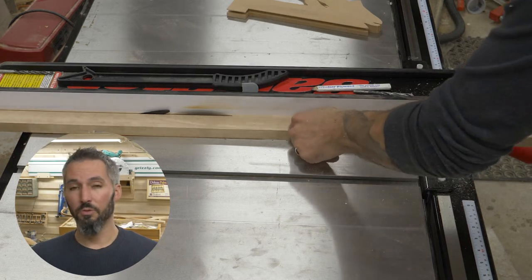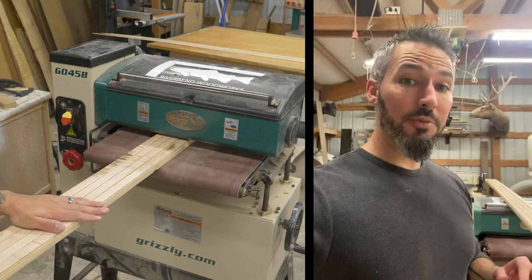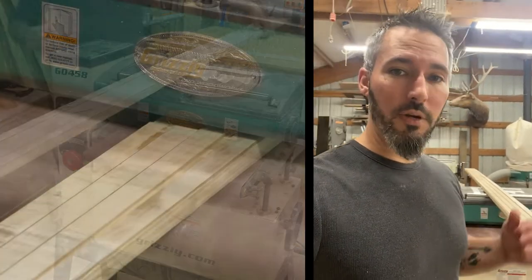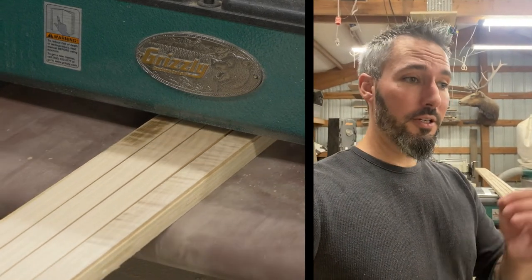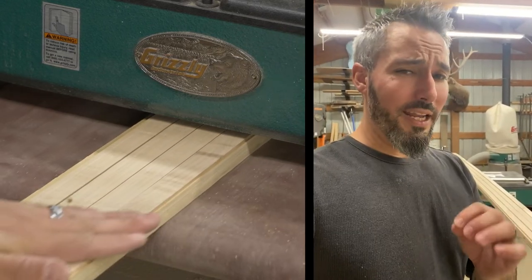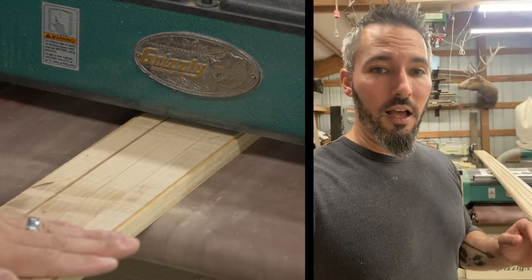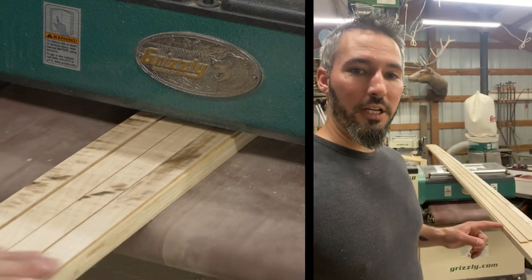I discovered with maple that you want to cut your net strips or hoop strips as thin as possible — think about an eighth of an inch right out of the table saw, then run through the drum sander. When it comes to making the best net hoop possible you've got to have really flat work pieces. You can have a really clean cut on the table saw and bandsaw when you're ripping out your 1/8-inch strips, but you still want to make sure the glue has something good to bond to and you have no saw kerf. The drum sander has about a 1/8-inch minimum thickness that it can run through, and you've got to pad that up a little bit.